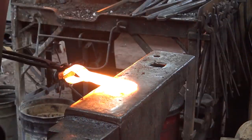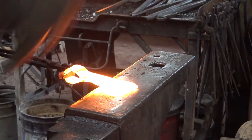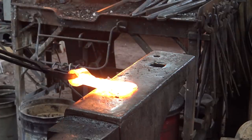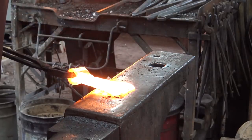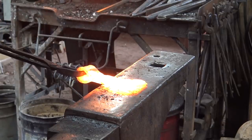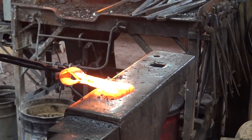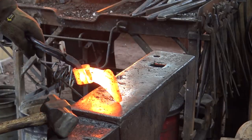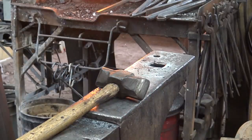Here I'm going to the big double diagonal peen hammer to spread the bit out. It spreads it wider without spreading it longer. I'll just use this for one heat, but it's still at welding heat. At this point, any forging on that surface that's been welded, I continue to work at a welding heat.